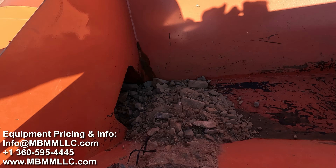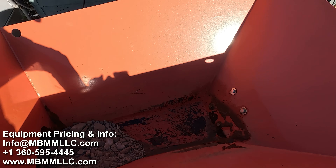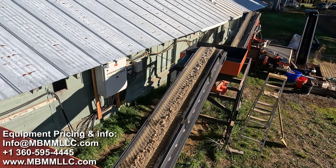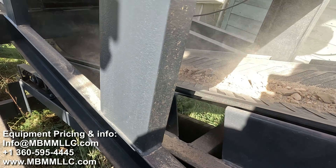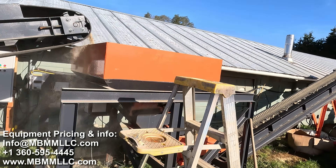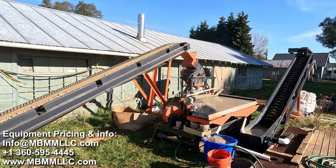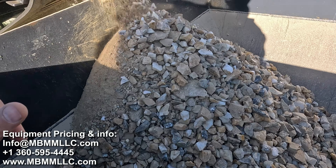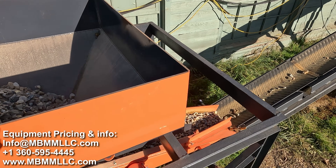This is our one-ton-per-hour turnkey system. It starts here with our jaw crusher module — we feed the ore into the vibrating hopper, it feeds down through the 8x12 jaw crusher, falls onto the discharge conveyor, and up into our holding bin for even metering into the hammer mill and shaker table. The holding bin is important because the jaw crusher gets surges depending on whether you feed coarse or fine material, and the hammer mill and shaker table need to be fed at a very even rate. The hopper holds about one and a half tons; the jaw crusher crushes down to about three-quarter or one-inch minus, the right size for the hammer mill.